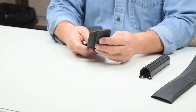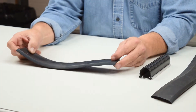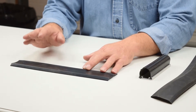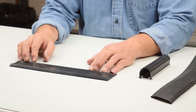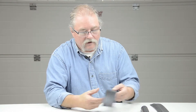Here's the other weather seal that is a nail-on product. This is EPDM rubber — solid, heavy, dense. It's a very dense product. If you want to change your weather seal and put on something that's going to last practically forever, this is the product to do. If you want a quick fix where you're replacing it with pretty much what's there, this is the way to go. It's a great product, very well made, real heavy-duty stuff. Same deal — pull the old off, pull out the nails, scrape it, paint it, nail it up. Door goes here, flap is on the inside of the door. That's on both of these.